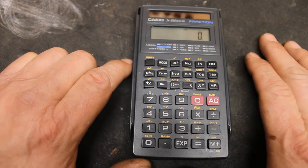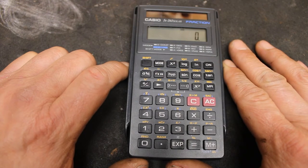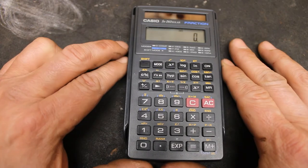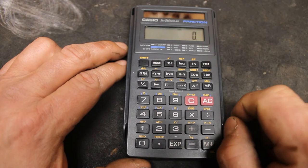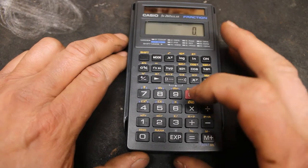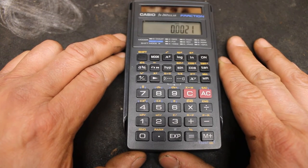That's coming in at seven inches. I want to show y'all the results of a formula I came up with a few years ago. For every inch of sight radius, 0.0003 inches — three ten-thousandths — is one minute of angle. So 0.0003 times a seven-inch sight radius gives us about two thousandths of an inch per minute of angle adjustment.